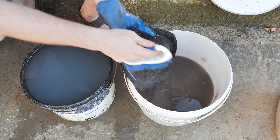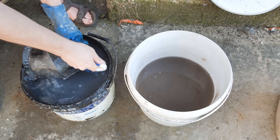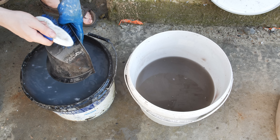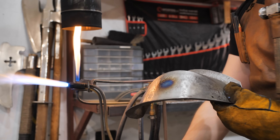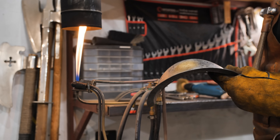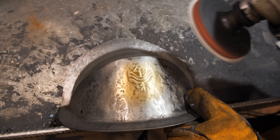This solution dissolves the scale in 20 minutes: one liter of orthophosphoric acid and seven liters of water. This scale is very hard to remove by polishing — it is clogging the grinding disc at once. Since the image is pressed in, it will remain yellow after polishing. The background will become white, and our rune will have a distinct outline.